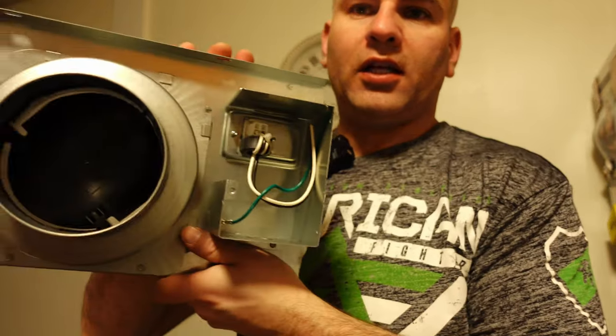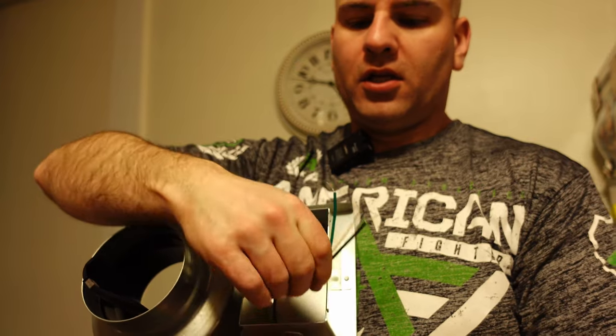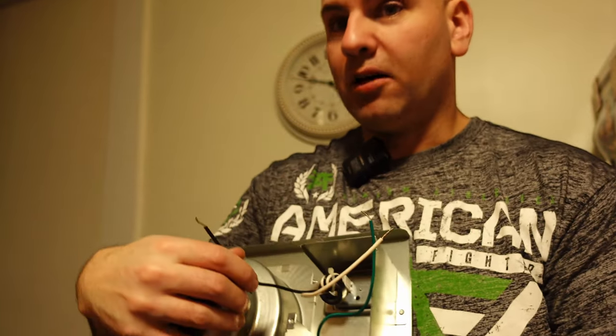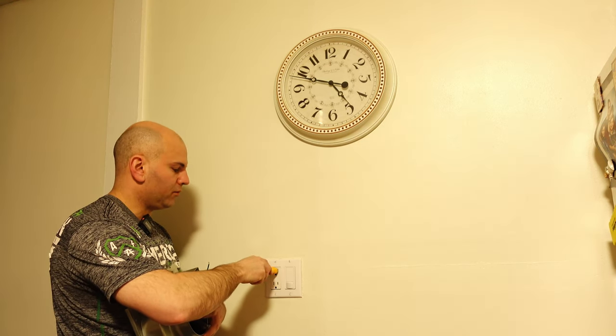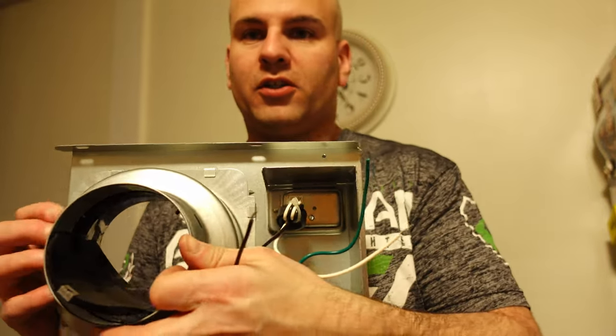On the front face we now have our connection for our electrical inside this little box. Taking that off, we're left here — at least the Canadian/American version — with these three wires. The green is always the ground, bare copper. This is supposed to be the neutral, which white normally in Canada and the US is neutral. But your house wiring may not be correct. So what do you do if your house wiring is not correct or you're not sure? If there's power to it, you'd hear a buzzing sound. Where there's power, this will make the sound. This is normally where your common neutral is, and your hot — hot means there's power to it, which is normally the black wire.